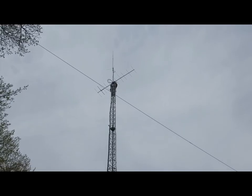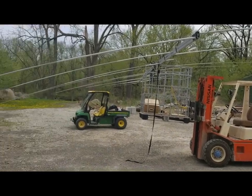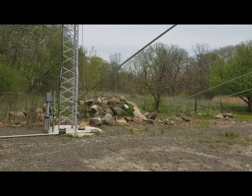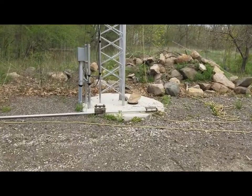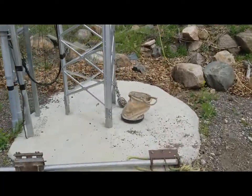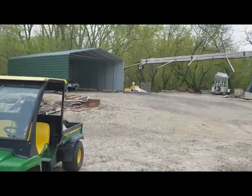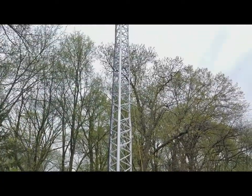The plan is to drive this forklift into the tower, straddling the elements, and use the gin pole. Get the gin pole up on the tower, and we have a bottom pulley at the bottom of the tower here, which the gin pole rope will go into, and it'll feed to the electric gator. We'll use that for raising the antenna. That's the plan. 73's. More later. W-Zero-G-E-N, we'll be clear.